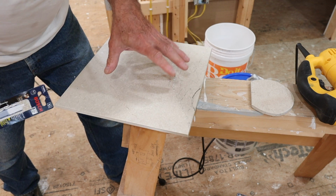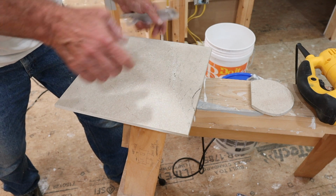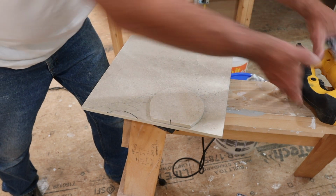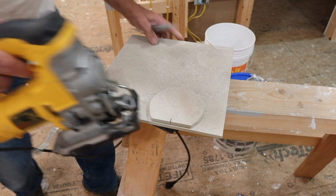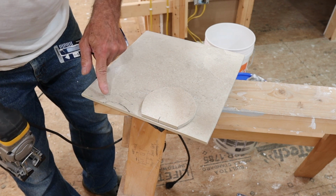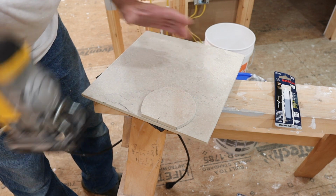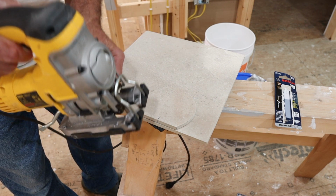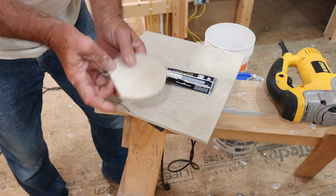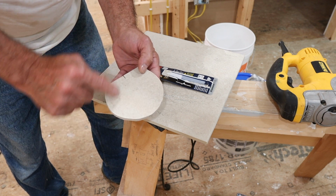And then in the backyard with the garden hose, my wife operated the hose on the cut line as I was cutting. Okay? She kept a continuous spray of water on that cut line, and the grease pencil, like right here, this is the grease pencil, it doesn't come off when water's on it. So the RPMs, you want to keep them low and just take your time and go around. It'll do it.